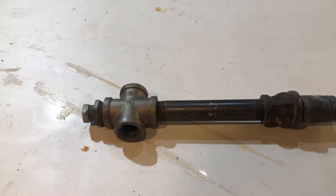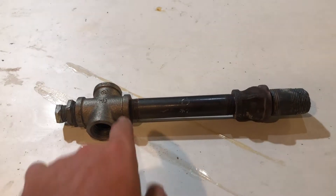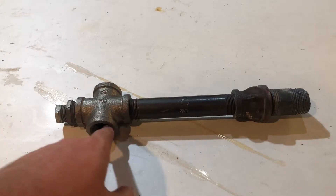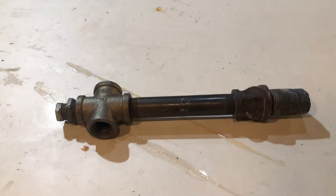Another note on the Venturi: when you saw me building my first forge, I was putting pipe dope on all the joints — completely unnecessary. Don't do that because it's just going to burn off and smell bad. This isn't sealed anyway from the Venturi side, and gas goes through at such high velocity it's not going to leak out through the sides. So don't put any Teflon tape or pipe dope on there.